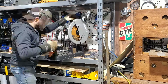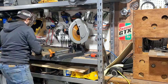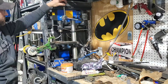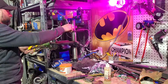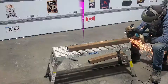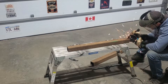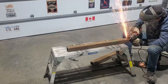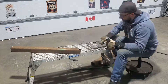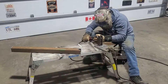I'm starting out cutting up some steel parts for the main mechanical section, which I'm going to control with pulleys and a hand crank. Then drilling holes in everything for bolts and pins. Now I'm cutting out a little opening for the wire rope to exit the pulley to get back to the hand crank. Then building the base that will hold the lower pulley, lower half of the jack section, and the hand crank.